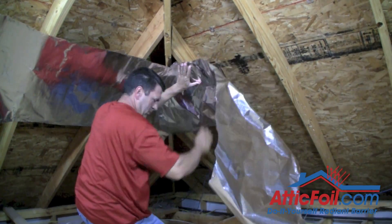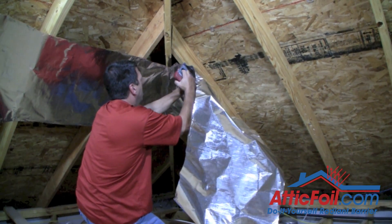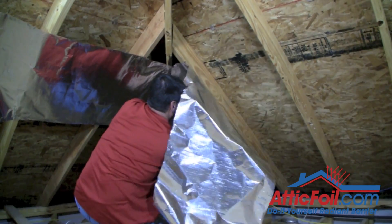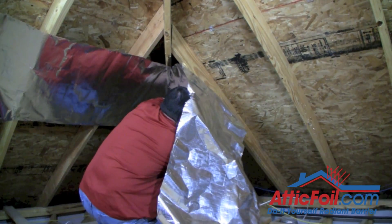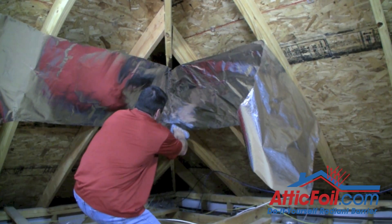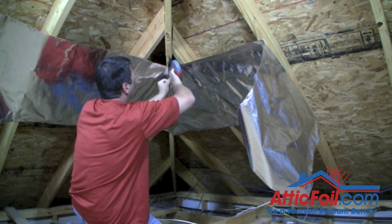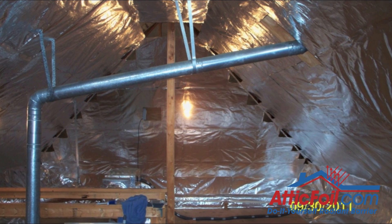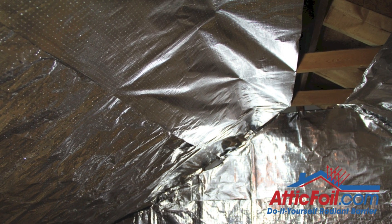You'll have a piece off to one side — flip it over, and that angle should line up perfectly to where you just cut. Then staple it a couple of rafters off to one side, and if you need to keep going, just start a new piece and go all the way down to your next stopping point. Where the hip rafters come into the corner rafter, you'll need to cut a small hole or slit so air can slide out and continue on to the roof. Basically, you don't want to create a dead end.